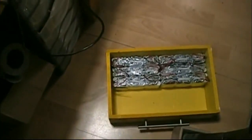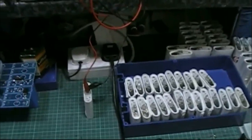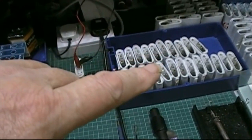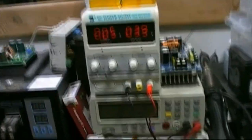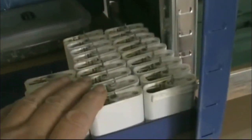If I get that chair out of the way then we'll be able to see. So I'm still harvesting batteries. That's the last of the prototype boxes, and then I've got a load in the shed — a council shed downstairs. These are down around zero volts, so I'm using this power supply to bring them up one at a time, and then they can go on my charging board.